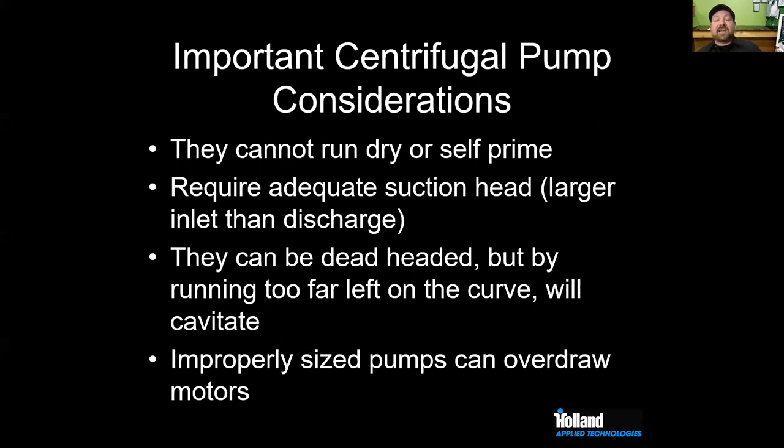James? Can I add, yeah, and also there's a lot of equipment out there and in setups where people are putting T's or valves or really sharp elbows right in front of the inlet of that pump, and that's just causing turbulence, which is going to lead to cavitation. Those pumps, correct me if I'm wrong, but I believe you need like 5 times the diameter length as your inlet. Yeah, that's a best practice for sure.